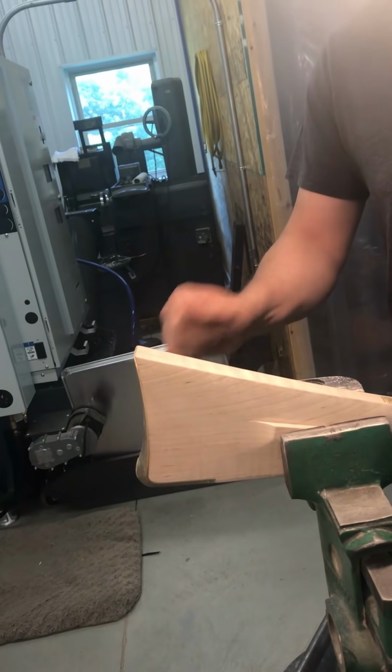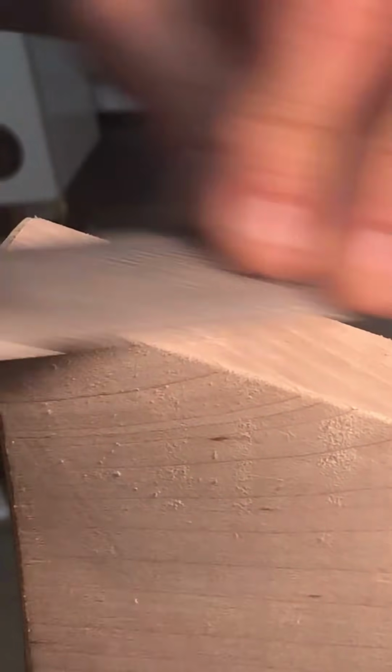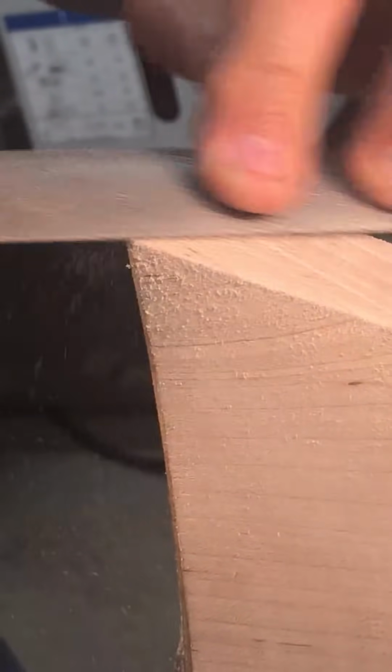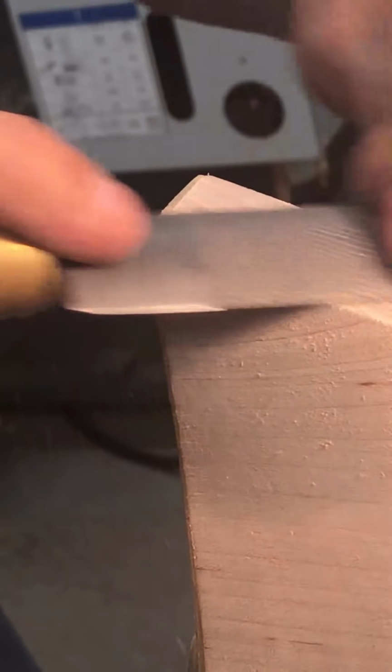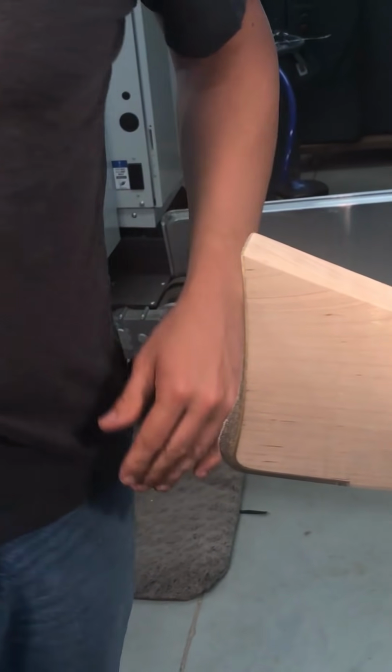And it's okay if the butt plate extends a little bit past the wood. That's acceptable, but you don't want the wood to extend past the butt plate. Here's a little fine rasp that I'll use, but I could just use some sandpaper too if I wanted. Lots of ways to get the job done. Now this rasp was a good quality rasp, but it's starting to go a little dull. Okay, that's looking pretty good. So we started to hit the brass.